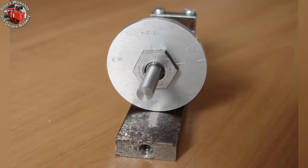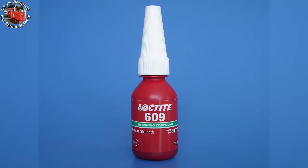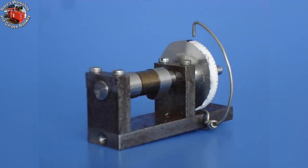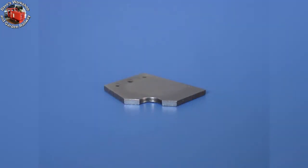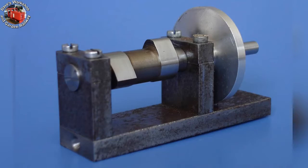Here is the division plate with the engine timing etched on — I made this when I had good eyesight. Here is the roughed-out base circle of the first cam. My trusty Loctite is used to attach items to mandrels for machining; it's highly recommended for when normal super glue won't do. I added increments to the division plate for the second base circle. Both base circles have been roughed out. The home-made radius gauge is for the exhaust cam. A 1/4-inch hole was drilled and reamed, and the excess filed away. The exhaust cam is complete, having been filed and polished.